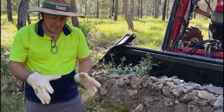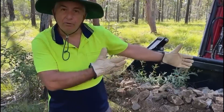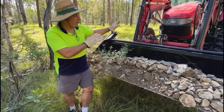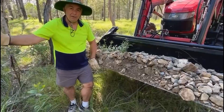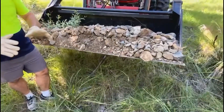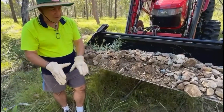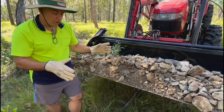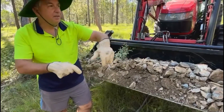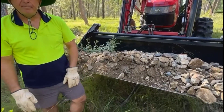This is the next area along the gully where we're going to put a leaky weir. I wouldn't normally recommend standing in front of a tractor on a hill — you don't want it potentially pinning you against something. However, I've put the slasher down, I've got the brakes on, I'm confident it won't move forward. Just a safety tip there. I've also decided, given the ground is still wet from recent rain events, to fill the whole bucket up and do one trip rather than multiple trips, so we don't damage that track over time.